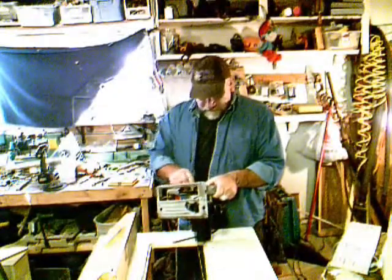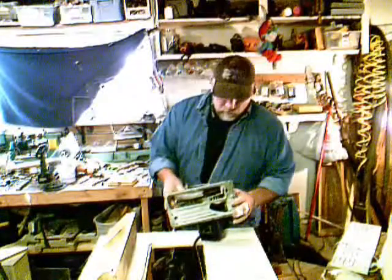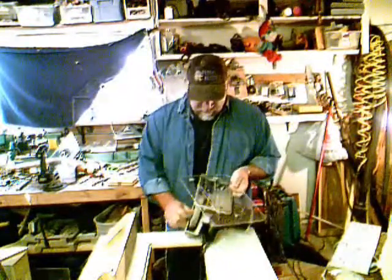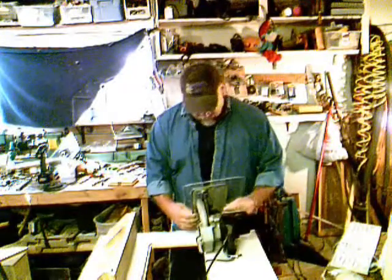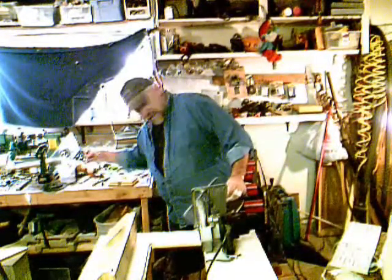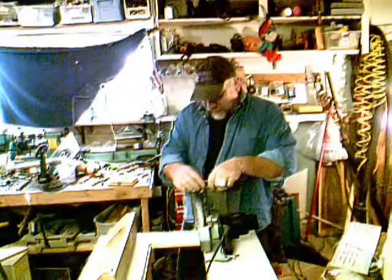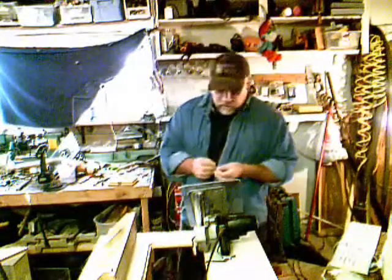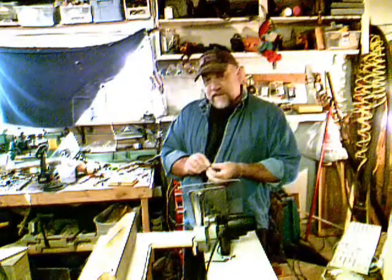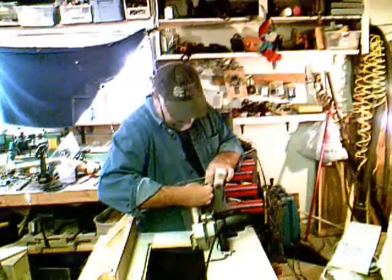Here's my saw — I changed the blade this morning and I want to make sure I've got that blade in there nice and tight. Now one thing you'll notice is since we put in the plexiglass, we're going to have the ability to make a slightly deeper cut because we don't have to make up for the full width of the wood we had before and we can use shorter screws. However, the drawback is when you drop the blade all the way down, it's not going to drop below the surface of the table.